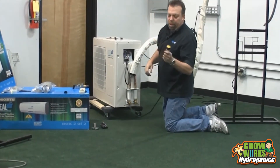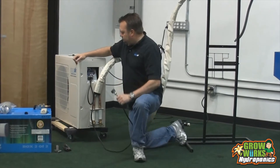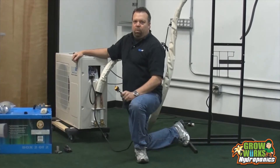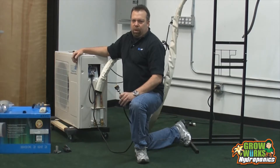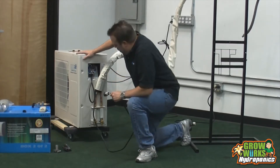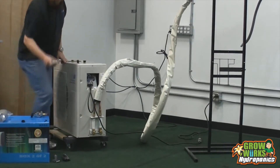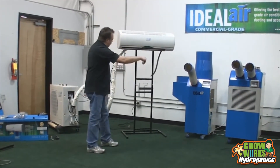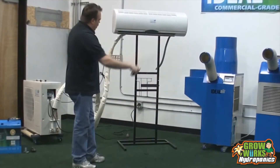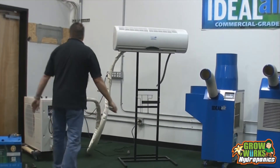I've already put a plug in on the end of the cord, but you'll have to wire this in yourself. Make sure that each one of these units, whether they're 240 volts or 120 volts, has its own dedicated power circuit — they need their own breaker. This is very important. Once the unit is plugged in, take the remote control and turn the unit on. You're blowing full.